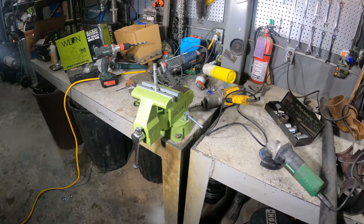Every winter, the paint would get all messed up on this wall. I think a big part of that was due to the water running off the roof and down this wall, because all the roof water would have to run down this wall, the stuff that didn't leak inside. And now that roof overhangs this thing like 4 feet. So that wall is just staying completely dry. Plus, I really rough scraped it down, wire brushed it, primed it, then painted it. So look at that, the paint is perfect.